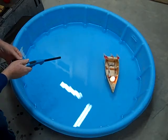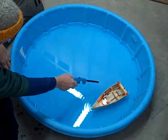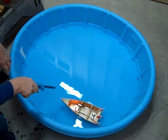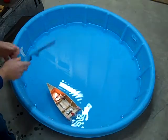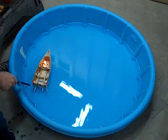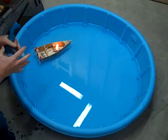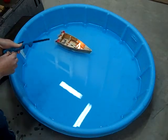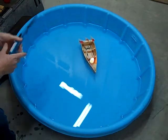This is based on the principles of a flash boiler. The flame heats the water very quickly and it boils almost instantly. The boiling water creates pressure which forces thrust out these ports. Then as the system empties, it creates a vacuum drawing fresh water back in, which boils and creates thrust.